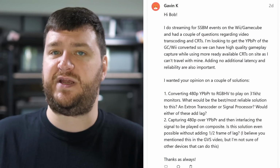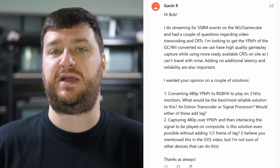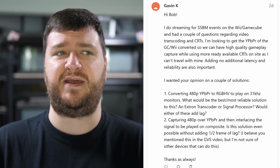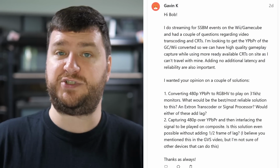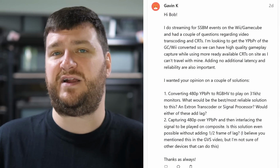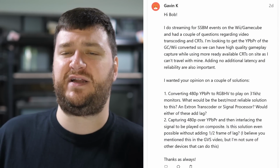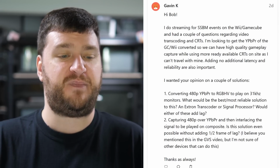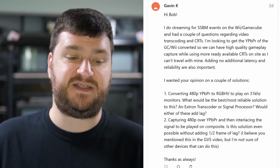The best way is to always double check with a time sleuth, regardless of anybody's advice. But I would just get a brand like Key Digital, Gefen, Audio Authority. There was a bunch of really good brands back in the day. I think those three are good, but find a higher name brand, buy it, double check it with a time sleuth. You might have some that are better quality than others, but not quality that would affect a tournament. Maybe you're not going to get as super sharp of an image with this as with that, but if it's zero lag, whatever.